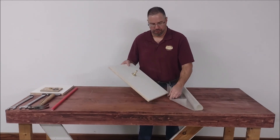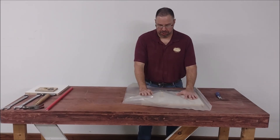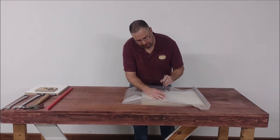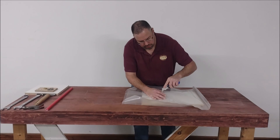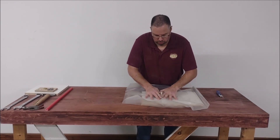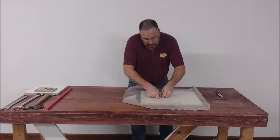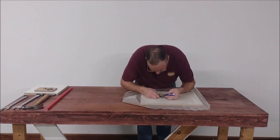This is going to be with the face of the baseboard face down. You're going to slide it into the bag. Once the baseboard is positioned in the bag where you want it, take your hand and push it over the top of the connector. Then I'm going to make a small X in the top of the connector. Once I have a small X, I'll push the bag over the top of the connector — you can see it comes down. Then you're going to push it down over the threads. You want to make sure that you push this down tight against that rubber washer.